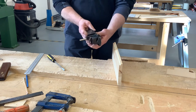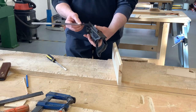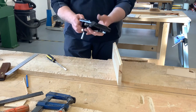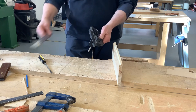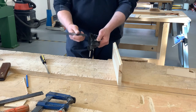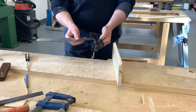I need to make sure that the corner of the blade is just hanging over the edge of the frame and no more. Then I'm going to take my rule and set the distance from the fence to the corner of the blade — in this case I'm going to use six millimeters — and tighten that screw up. I'm going to check it, make sure it hasn't moved. Then I set the foot so that the blade will cut six millimeters into the material, loosen off the adjustment screw, push the foot in with my rule until I get to six millimeters, and tighten up the locking screw.